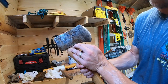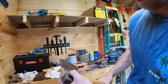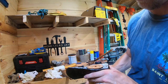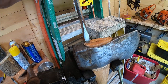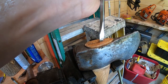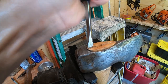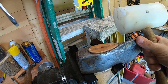This is how far we got — I hit my hand a little bit, but I cannot get it to go any farther down. I think the eye was a little bent; I had a heck of a time getting it in. Normally you'd bring it down to the shoulders, but this is going to be fine — this axe head is never going to move. Now let's work on the wedge. I'm going to take a screwdriver — a chisel would work better — and pound this back into the kerf cut to reopen it, because we're going to need it open to pound our wedge in.